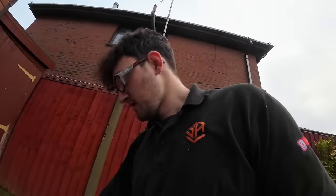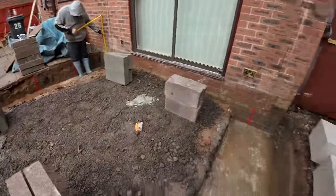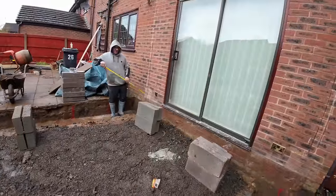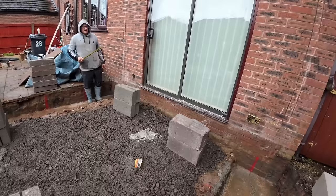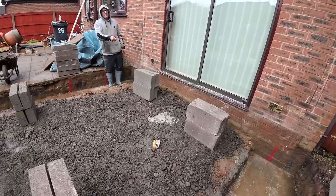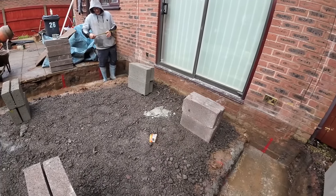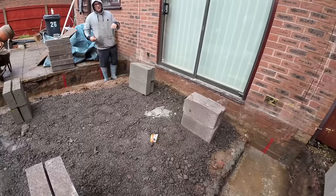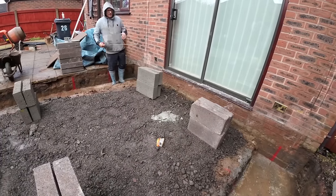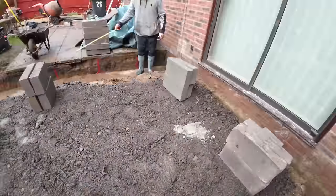Well, that's good news. When you consider how much concrete actually went in here, that's good that it's managed to get it within the regions. That's 10 mil higher than that. That's 50 mil low, that concrete to gauge, it's 540, but we've done it to imperial gauge. So 540 is just over 21 inches, so it's nice beds to get us up. This side is just a little bit tighter, but still gauge. Everything's still gauge. Nothing's too tight, just this middle.